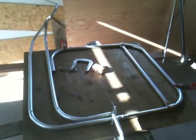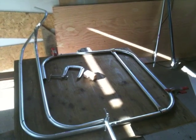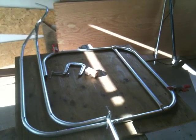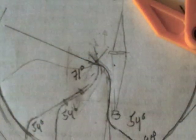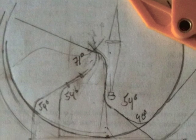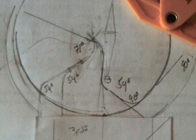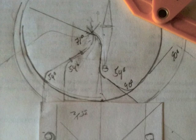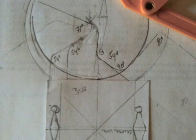I am using electrical conduit to construct a frame that will hold the wheels and serve as a trailer arm. You don't have to use a plywood base if you are good at bending the pipe and intend to attach the tubing directly to a solid structure like a box. I wanted to support lots of weight, so I am choosing to attach the plywood to the electrical tubing for added stability. I worked out on paper the shape and degree of bends the pipe would need, scaling down a model to visually adjust the amount of turn the trailer would get in relation to the back wheel of the bike.